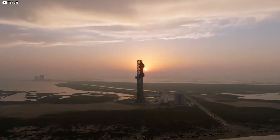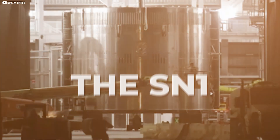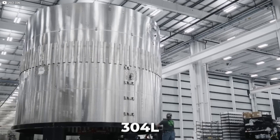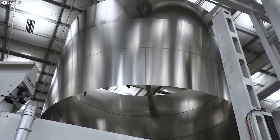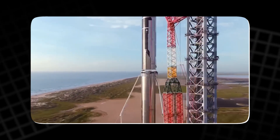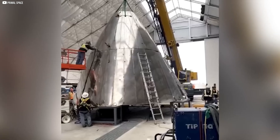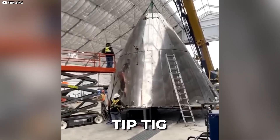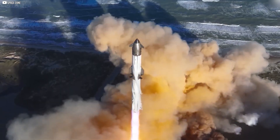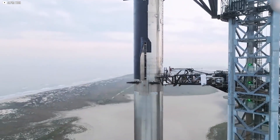After learning from past failures, SpaceX made significant improvements to Starship's design. The SN1 prototype used thinner stainless steel sheets, reducing the need for welding. They also switched to 304L stainless steel, which resists corrosion better during welding. SpaceX adopted tip TIG welding, which improved the strength of the joints and reduced weight by 20%. Instead of manually forming parts, SpaceX started stamping them. This change, along with the use of tip TIG welding and laser welding, allowed for more precise and stronger connections. Laser welding, known for its accuracy, let SpaceX weld entire sections of the rocket in a single pass. However, an additional step was still needed to make each weld even stronger.